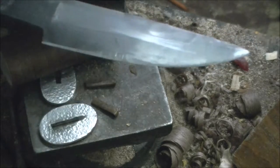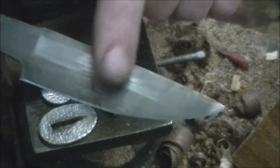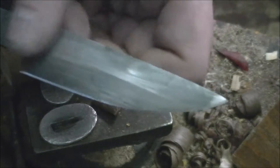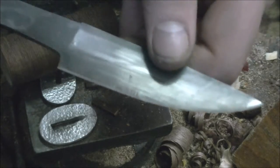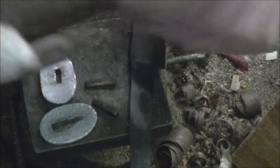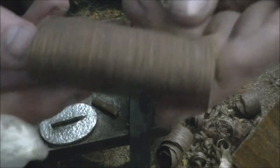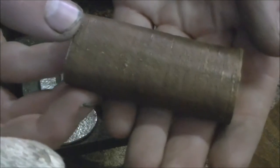I'll probably go over this with some 400 or 600 grit and then redo the process again, so that when I put it in and out of the sheath, the friction won't just rub off the oxidation - it will stay on the troughs of those ridges. This handle kind of looks like a bobbin almost, and really it is because I took some string, wrapped it around there, pulled it through and then lacquered it up. It's just a very simple handle.